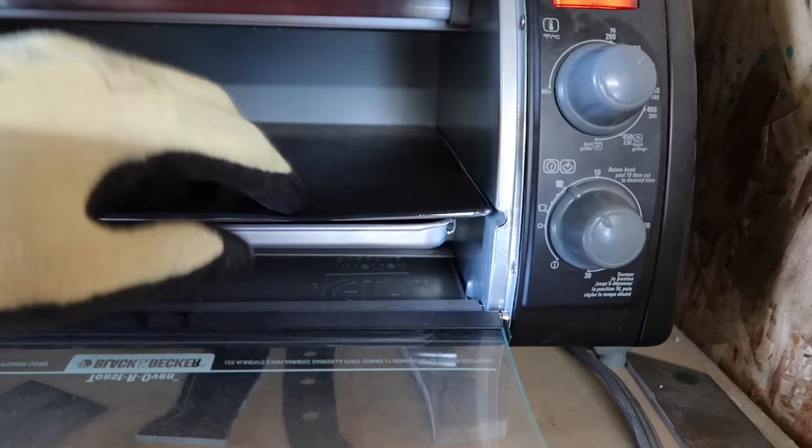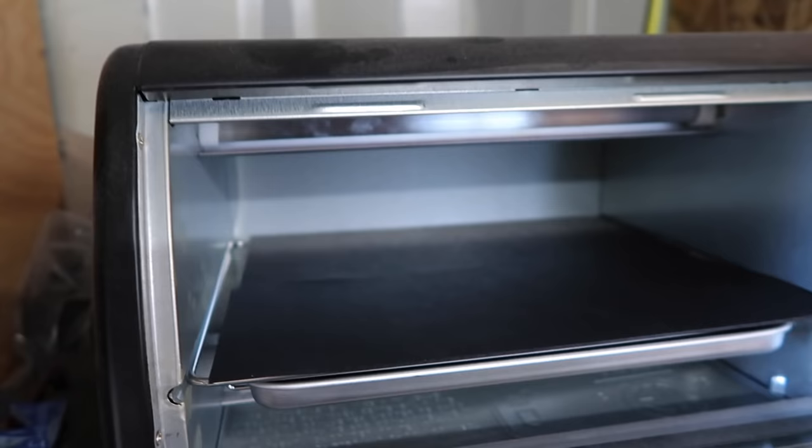It's only been a minute 43 seconds. It's already starting to soften up quite a bit, as you can see. A lot of people say they like to leave it till they start to see a curl on its own, and that actually seems to work fairly well. So we're gonna give it maybe another minute or two. But as you can see, this is a very quick process, the heating up of the Kydex.